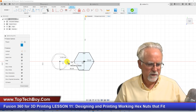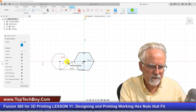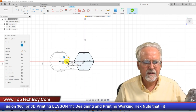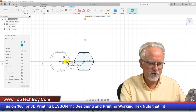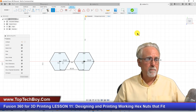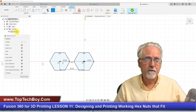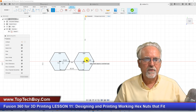And then I want to come out 25, so I type in 25. What did it not like about that? I click in 25, and there it is. And now I try to get it to snap to that construction line. Click enter. It is not fully constrained, but I think if I select this and tell that one to be horizontal, then boom, we have a most excellent fully constrained sketch. Now we need to put our circle in,